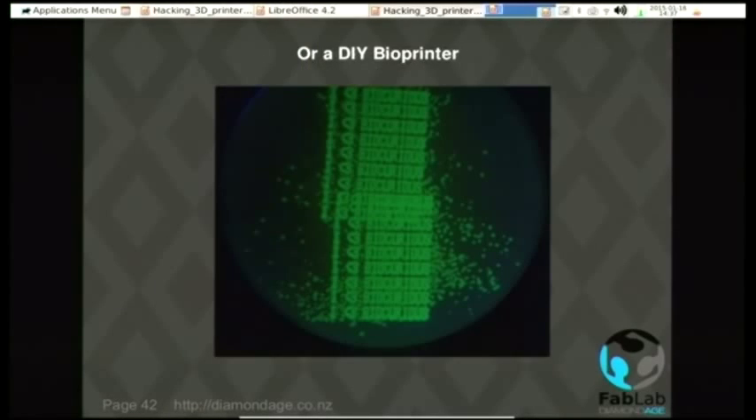The original inkjet shield was actually done so you could print biomaterials. You have to be careful to get the right cartridge if you're going to play this game at home, because there are two kinds in inkjet world. One uses a piezoelectric element to push the ink out of little holes — that's the one you want. The other passes an electric charge into the ink, vaporizes it as steam, and that steam pressure pushes the now-cooked biomaterials out of the nozzle. You don't want to use that one.